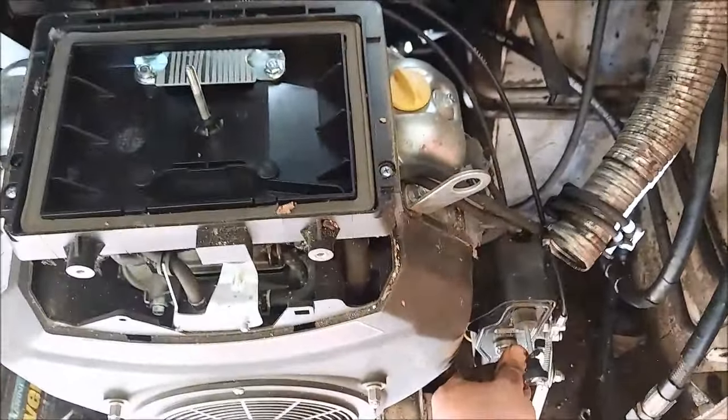And I'll turn the settings down to the lowest I can. I'm just going to cut here, cut here, cut here, and fold the ends in and grind it and try to weld it. And if it works, then we're pulling that engine. And those are the two, the original muffler. I'm going to cut those off there and then run them into this pipe, weld that around. I just want the engine turned around so it's easier for me to mock that up. So let's just start by cutting this and seeing if I can weld it, because I might have to go with a thicker pipe.